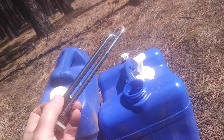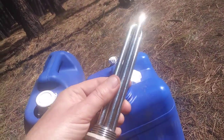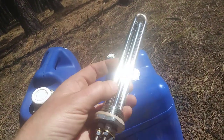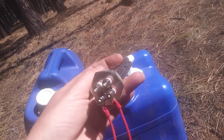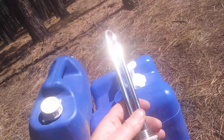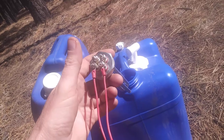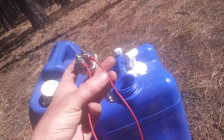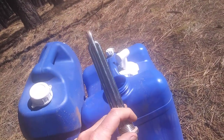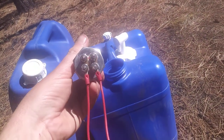To get this thing super hot, you're going to want to get it closer to its 25-amp rating. If you had 400 watts of solar, that would be putting out around 22 amps pumping through this. If you put 400-watt panels in parallel, you should be able to get at least 20 amps out of it — then this sucker is going to work really good. It would actually probably heat the water up so hot I'd put a thermostat in series to adjust the water temperature. That device was like 20 bucks — very easy to hook up.